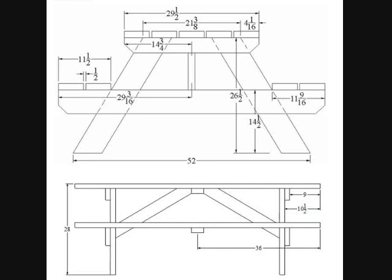At this point it's probably about the right time to fire up the grill! While that's getting hot, put those two A-frame support boards on underneath — run a couple of screws through the inside support and a couple down through the top. Then screw the little center support boards on the seats. You won't think they're doing much, but they'll keep the seats from warping apart and being uncomfortable for the two people in the middle. At this point your brats are probably starting to brown — go ahead and set that table where you're going to leave it.